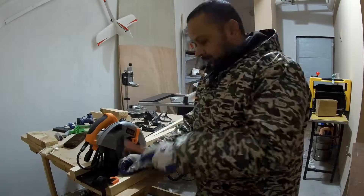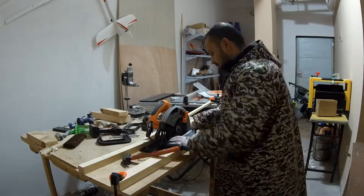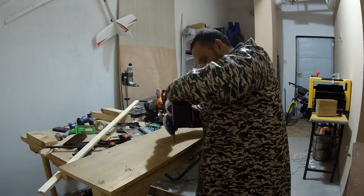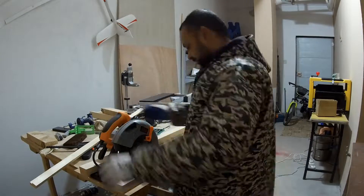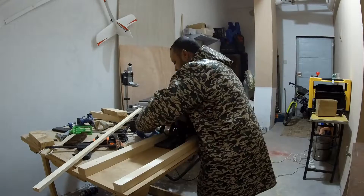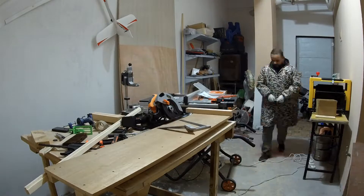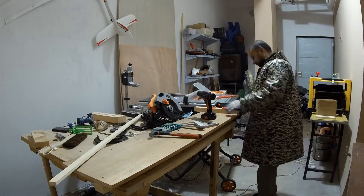After adding that, I had to check if my circular saw actually moves right. I also used a piece of cardboard — not very thick but thick enough; basically it was just a user manual piece — and put it between the saw and one piece of wood, the fence. This way I made sure the saw will not have play but will also move right.